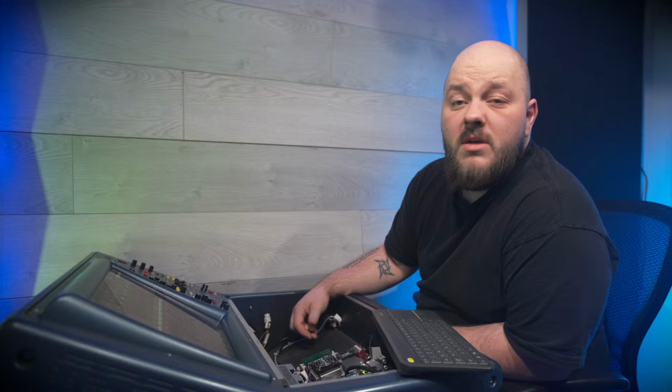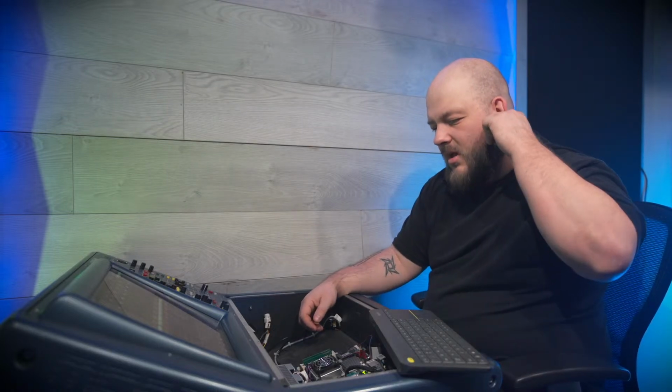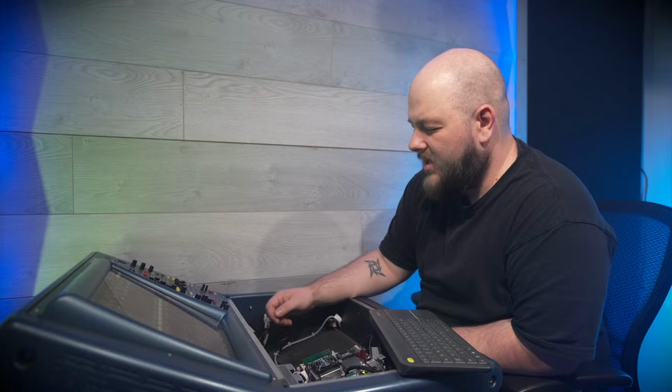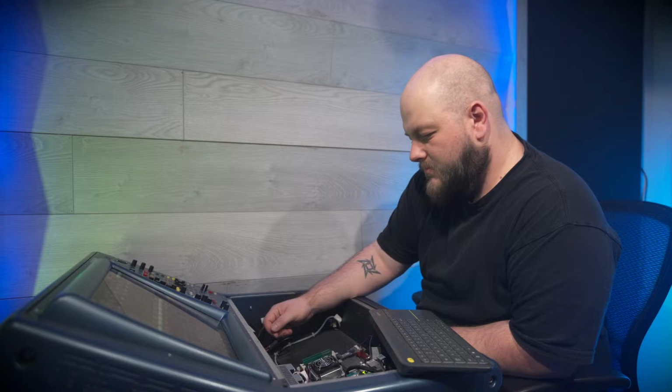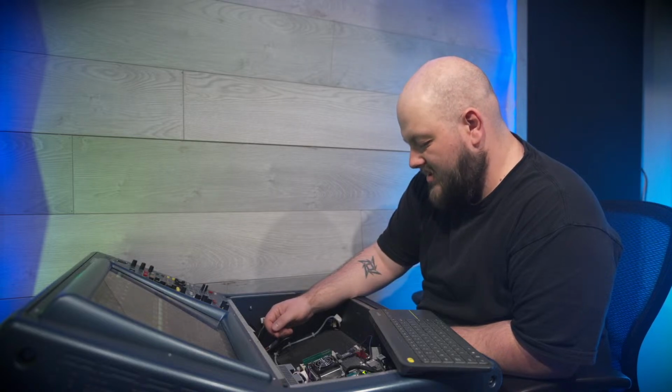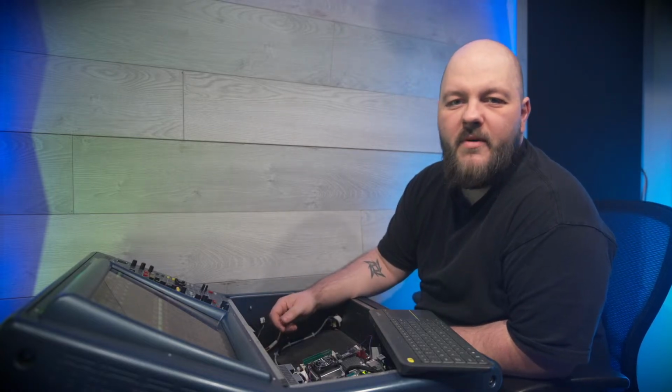DD is just a tool to make a one-to-one raw copy of the disk, bootable code, partition, and everything. Okay, so I'm a Mac OS user. We have a software that is called Carbon Copy for that. It's going to be an exact replica of your drive. So if I Ubuntu this thing, I could probably copy the drive. That's what you're basically saying. Bootable copy of the drive.